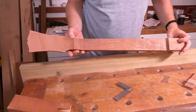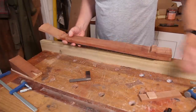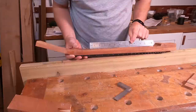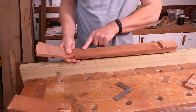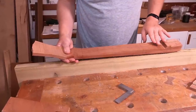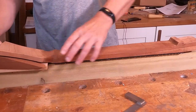I've just done a little bit of preparation work to get this ready for the neck carve - put a center line on the back and I've also marked at the first and the twelfth frets so we've got some locations that we can start the carve on. Now you might remember I only rough cut this on the bandsaw and the back of the neck is a little bit uneven. But I'm not going to straighten this up - the simple reason being is we're going to take the vast majority of this material away anyway, so I might as well just address that unevenness on the tiny little bit of remaining wood down the center. Absolutely no point spending time cleaning the whole of this up just to carve it all away again.